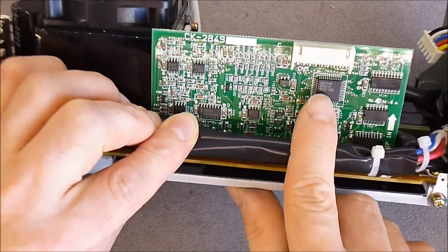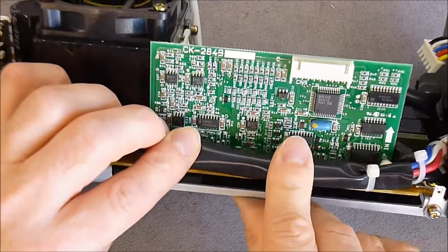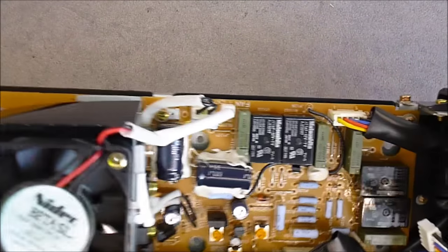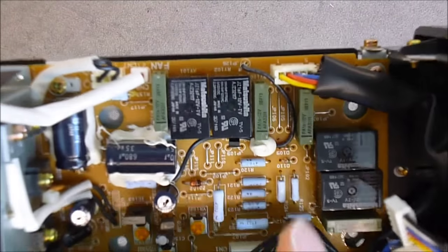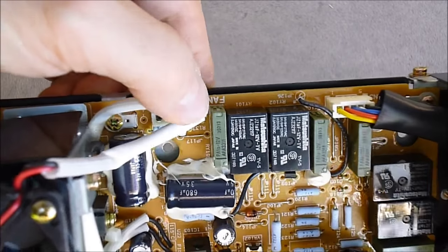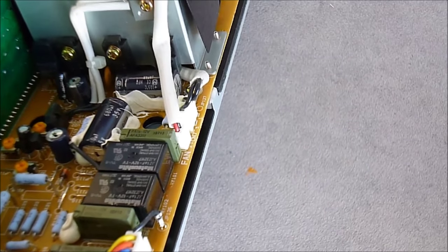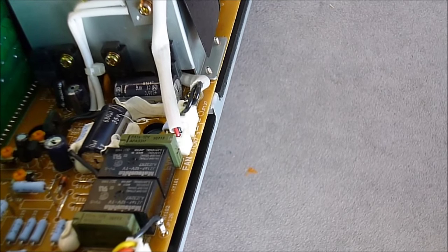Here we have the brains, with one little brain chip marked BDE-03AB. The date code reads 1993. Here we have some relays — it seems each battery has two relays. One is a regular Matsushita black box relay, a very common kind. The other is very interesting — very tiny, brand NAIS, rated 3A at 200V AC or 3A at 30V DC.